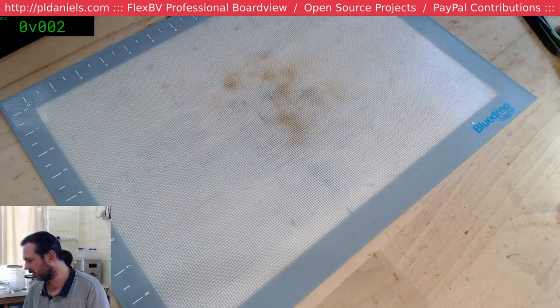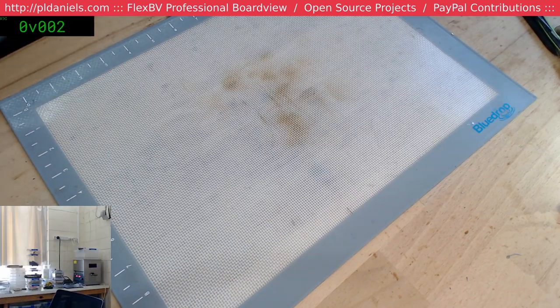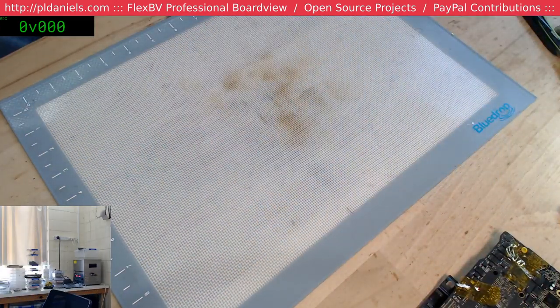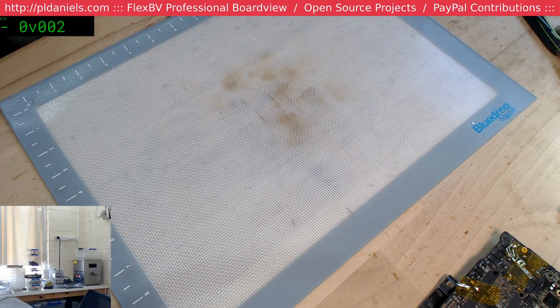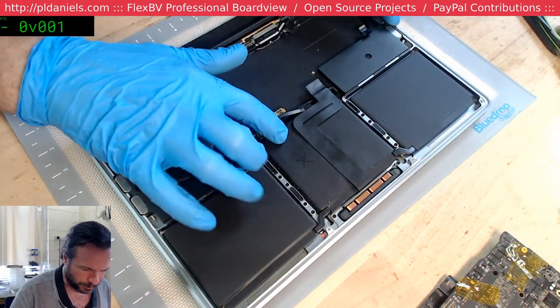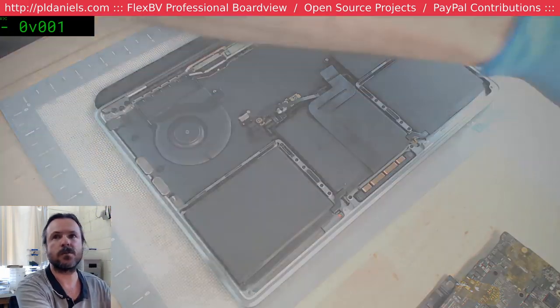Okay. Alright, let's get to this 1708. I'm not really keen on the 1708s, but that's life. There are worse boards. Now the problem I have with the 1708 on this particular one is that it's simply not showing up. It's not detecting or not charging the battery. And the battery doesn't look 100%. This is the one that took water damage.